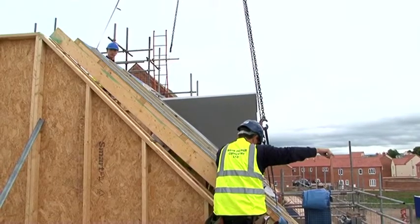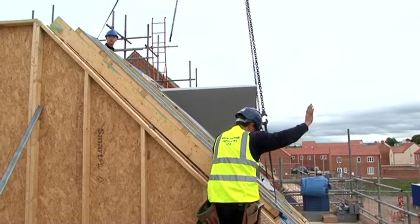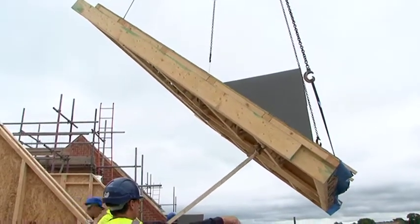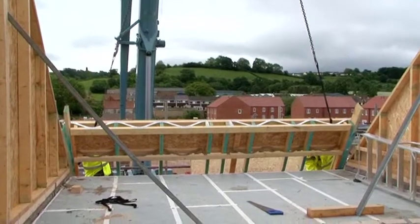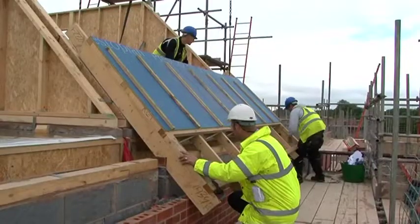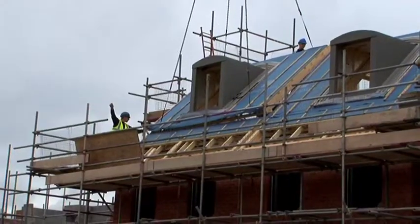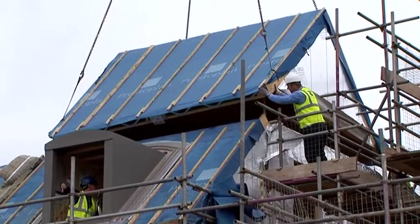As the cassette is lifted, the slinger moves onto the scaffold and continues to direct the lift. This enables controlled positioning of the press roof cassette. Taglines should also be used to assist positioning. Even loading onto the gable panels is important. The press roof cassettes must be installed sequentially in pairs, starting with the eaves, followed by the aperture panels, and finally the ridge section.